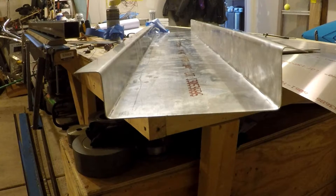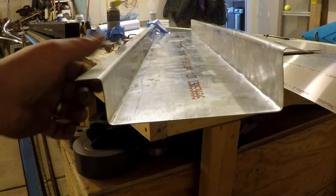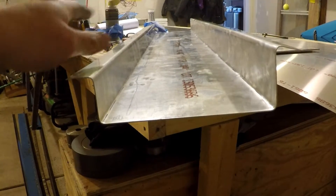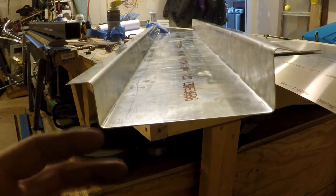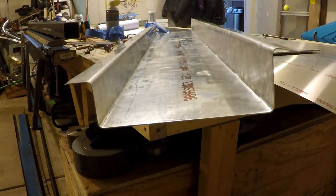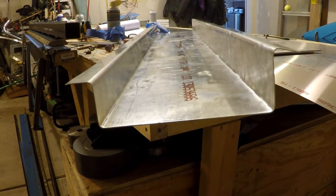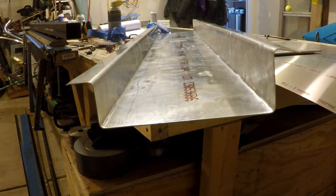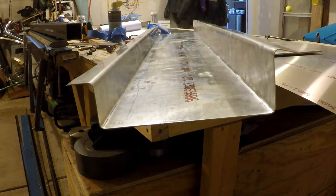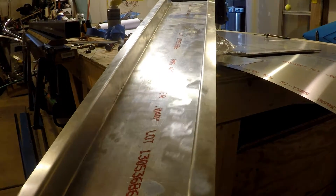This was an extremely difficult part to make with the bending brake I have, but I'm very pleased with it. I've got a little bit of hand adjustment to do here and there, and I'm hoping that'll straighten out the measurements slightly — it's a little over-broke in the middle on this section. Metal does some funny things when you start to bend it; it buckles in weird directions and pushes back in places. Clamping force is critical, as is having a good solid bending arm. There's some flex in the bending arm that happens even on industrial brakes, more so on DIY brakes, and that can account for some of this irregularity.